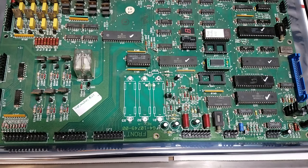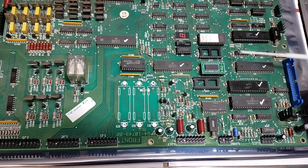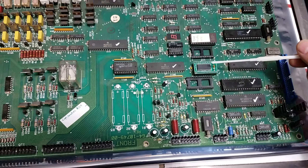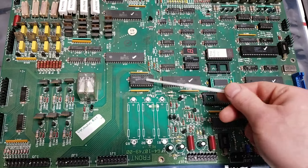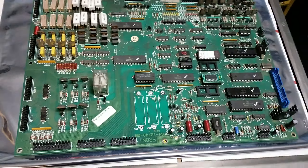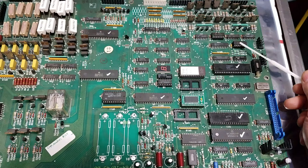The resources point out that if you cross-connect them, your processors can get fried, your game ROMs — this is the game ROM, the sound ROM isn't installed right now — can get fried, your RAM might be an issue, and also U41 and U9. On this particular one, when I bought it seven years ago, I noticed that U41 was already replaced, so I figured that was good.